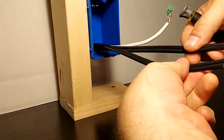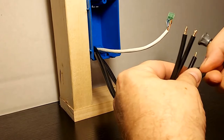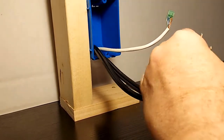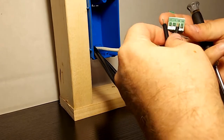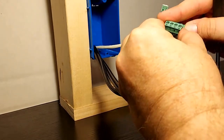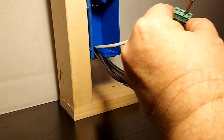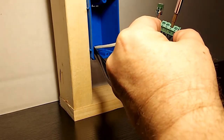Let's move on to the speaker wires. Again, these are already trimmed and twisted, about 3/16ths of an inch. Make sure there's no stray conductors and then we'll put them on the terminal strip. The strip is labeled for both left and right speakers and identifies positive and negative for each. Insert the wires in the hole, snug them down, and that's all there is to it.